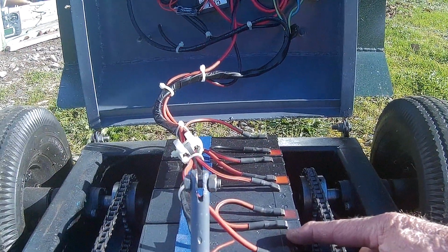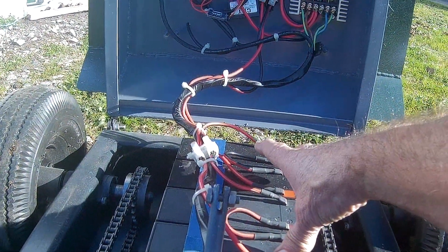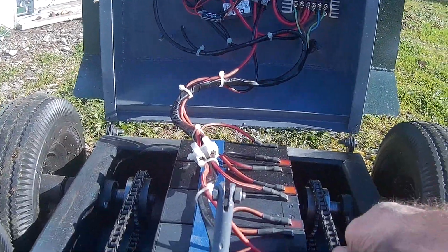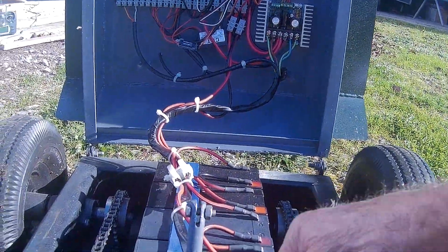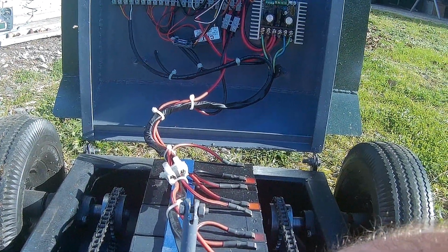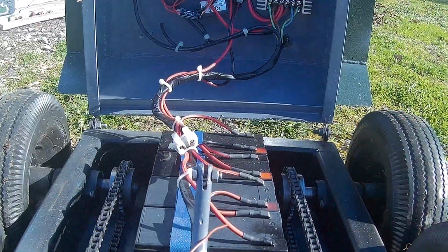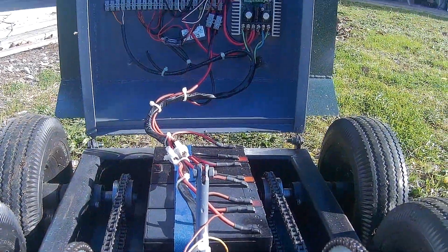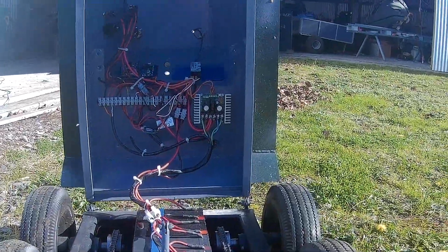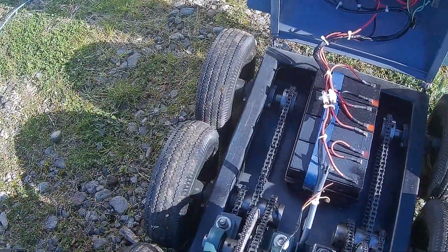We've got, I think they're 7 amps. So they've got two banks of 7, so there's 14 amps at 24 volts. All these here I had to grub screw all the sprockets on, and even after I grub screwed them I still had to bore them into the axle a little bit and then Loctite them, because they were just spinning. So next one I build, I'll put a lot of keyways in. I didn't realise there was going to be so much torque on this thing. So it works very, very well.